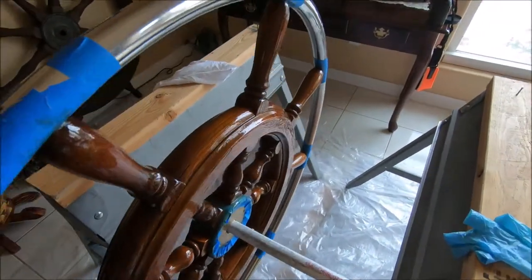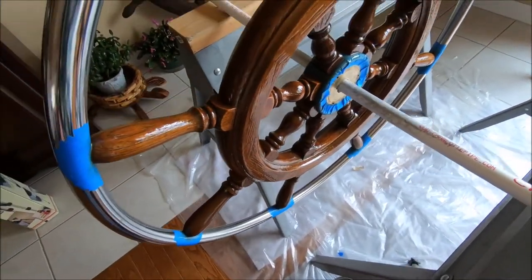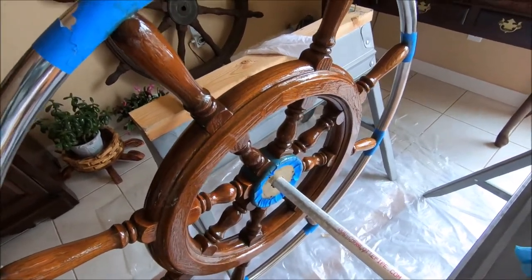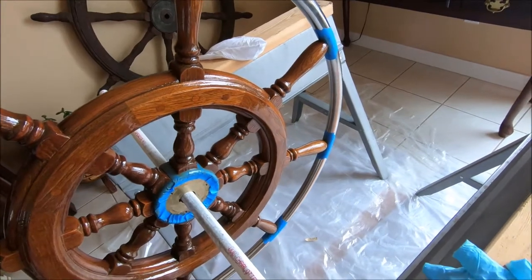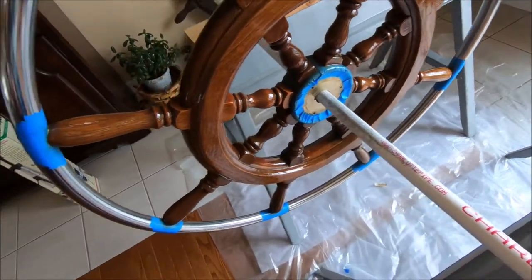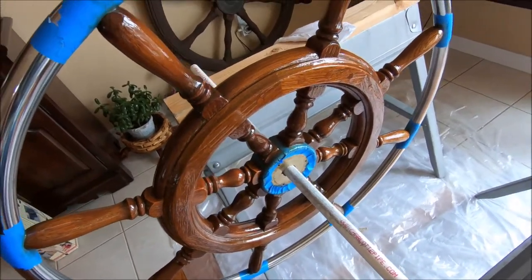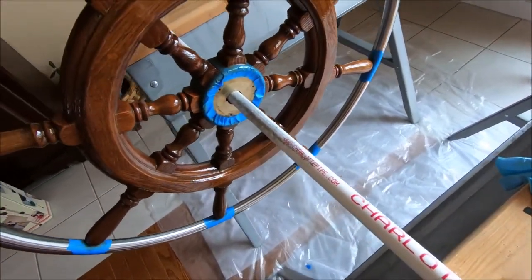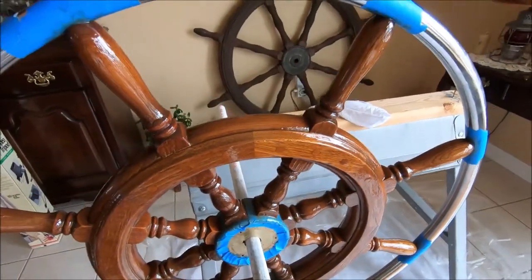Don't know if this is going to be useful to anybody, but Cetol Marine, the product seems to work fairly well. Time is going to be the big test on that. As I say, I've got some of this finish on the exterior of the boat as well as varnish. It's easy to work with, but you've got the two-part method if you want a glossy finish, whereas with varnish you're still doing several coats of varnish anyway. So my big concern is going to be what happens if you let this weather too far, how tough it's going to be to strip, if you can strip it off at all. Varnish, not that it's easy to get off, you can get off with a heat gun fairly easily. This you probably can too, I don't know.